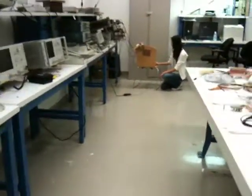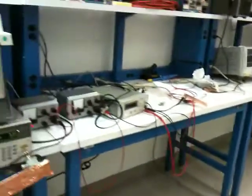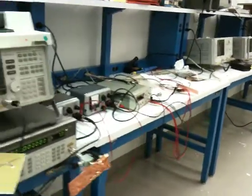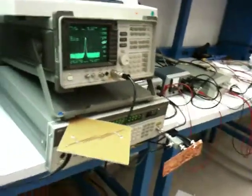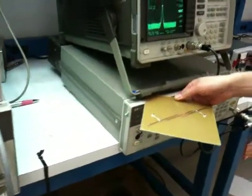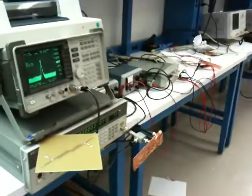Okay, why don't we switch it over to something else? So, we can't quite determine the longest distance we can successfully transmit because it turns out the edge-coupled bandpass filter itself picks up enough signal for successful demodulation. Here we'll demonstrate that — we disconnect the antenna and it still successfully demodulates and we pick up the audio signal.